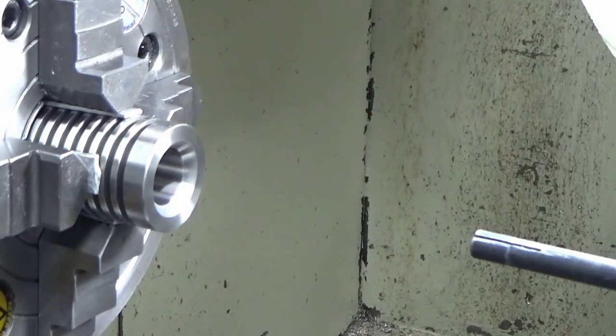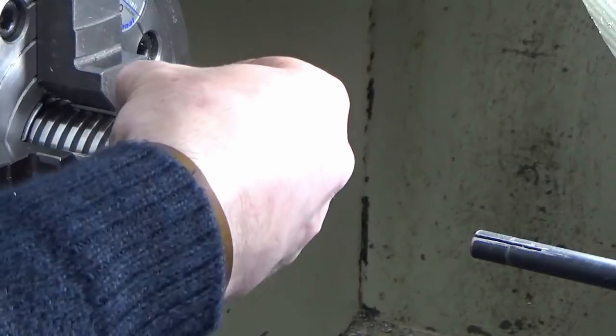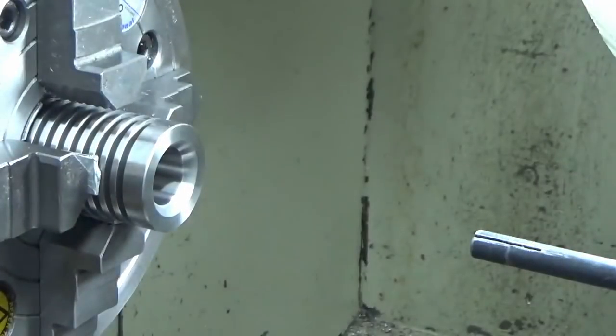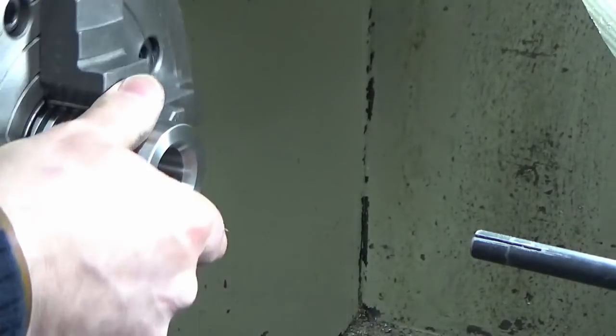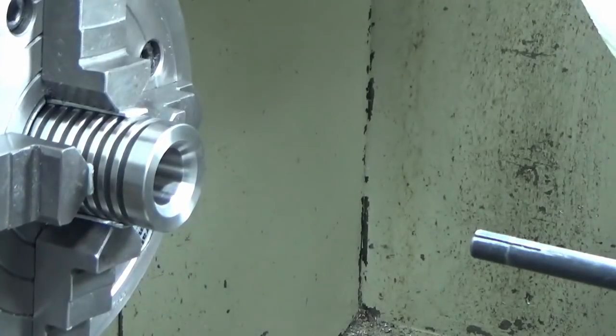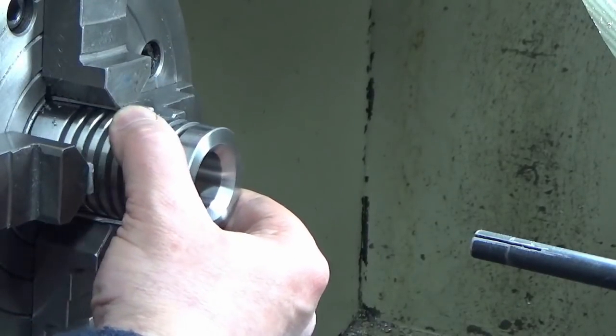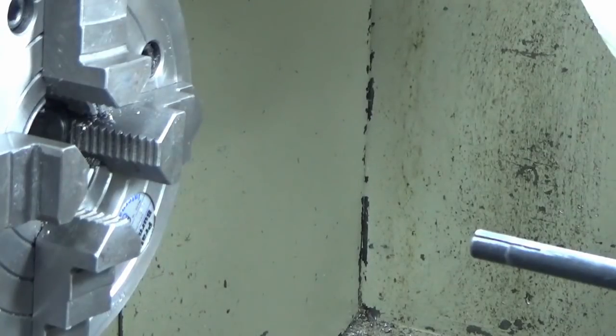I've been doing some measurement as well, and I've got the 10 microns taper down to, best I can measure it, 2 or 3 microns taper through the bore, so I'm fairly happy that we've got that to a reasonable state.